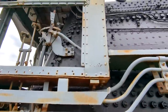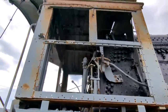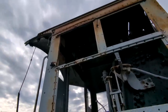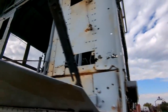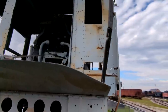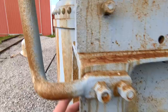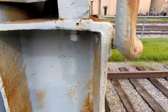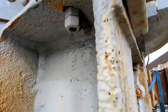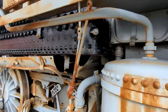You can also see there are some pinholes on the cab sides — we took the paneling off and we're going to have to replace it. You can look through the top of the roof and see some daylight peeking through, so fixing that roof is one of my first priorities. On the back, any thin metal really is going to need repair. Additionally, any piece that's bolted over something — like this handrail — will have to be removed, the rust inside taken out, and then reassembled with paint on both sides so it doesn't happen again. When you have two pieces of metal together and rust forms between them, it becomes extremely destructive.